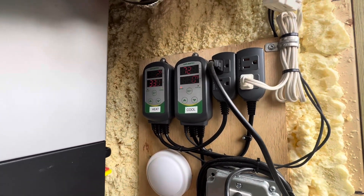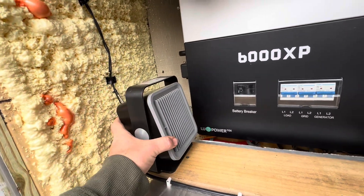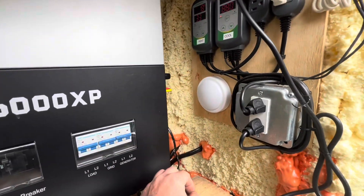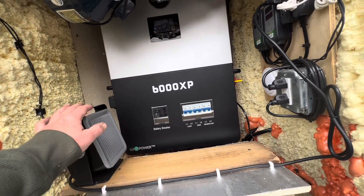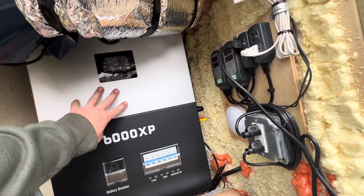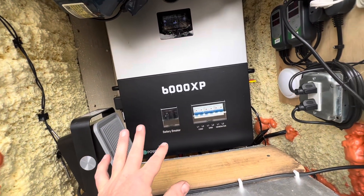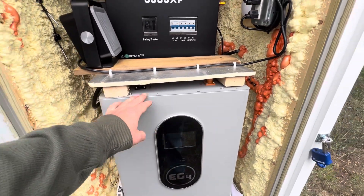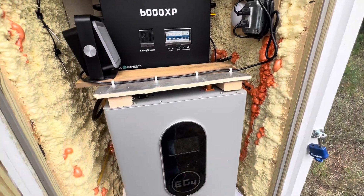I gave it more than a 10-degree dead band. So if it drops below 33 degrees, it'll turn this little 300-watt space heater on in here, just to warm up this cabinet. It's super well insulated, to keep this inverter from getting too cold, which will discourage dew formation. Usually the inverter's gonna kick out heat anyway, so this thing very rarely, if ever, will run. And usually if it's that cold, it's probably dry as a bone out. So it guarantees the battery is always brought up to state of charge.